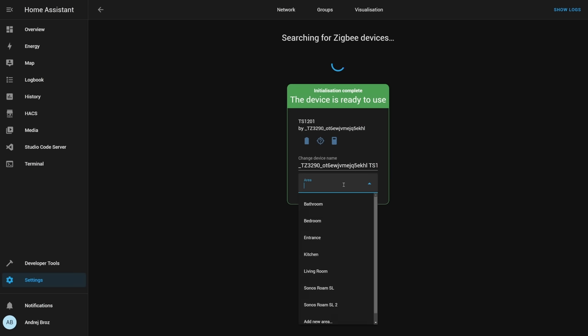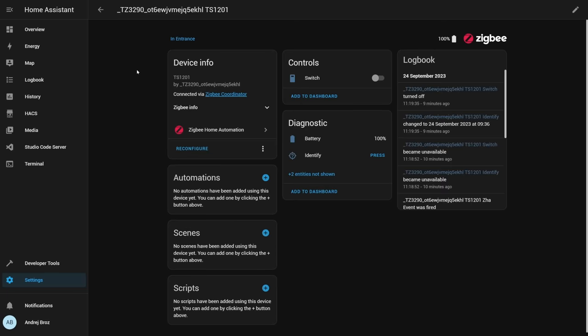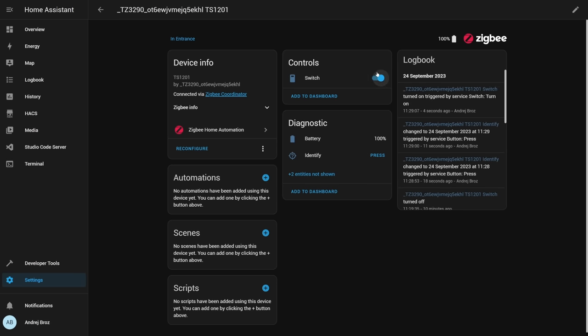The only thing I could do there is flip the switch, turn it on and off. And actually that switch did nothing. At first I thought that turning the switch on will put the device in learning mode. But even if it did, the LED on the device never did start to shine, and I did press a couple of buttons on the remote, but I couldn't get any state back inside Home Assistant. That means, no, currently the device is not supported with ZHA.